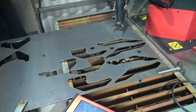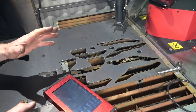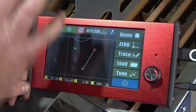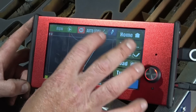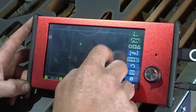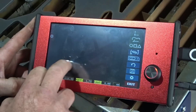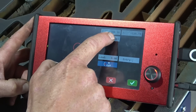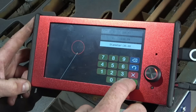I've decided I made a mistake — I want that hole to be 30mm. Can you change that hole to 30mm? So, while the program's still on, you just go into Trace and you can zoom in. There's the circle — click on it and you can edit it. John needs a 30mm circle, so now it's turned to 30mm. Right cut, entry cut — confirmed.